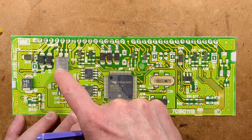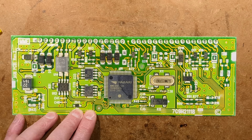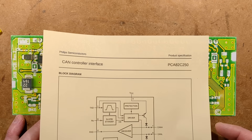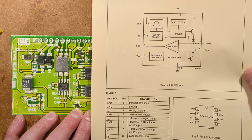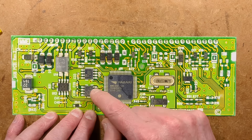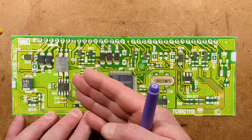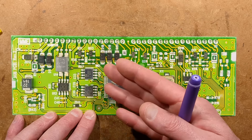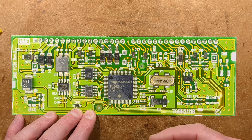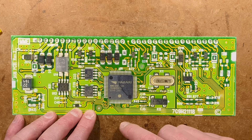Here is the CAN chip with a filter - two little inductors and the CAN chip. It's a PCA82C250, and it's a fairly generic CAN controller interface. The CAN bus was originally developed for the motor industry as a rugged low-speed interface for communicating between control modules, but now it's used in elevators, factory equipment, and theater lighting - the moving headlights use CAN communicating between the different modules.